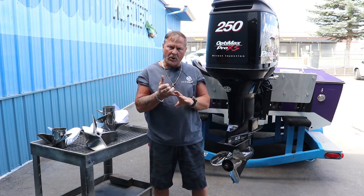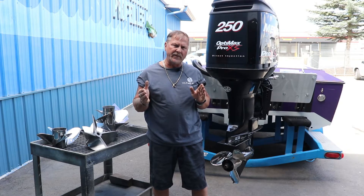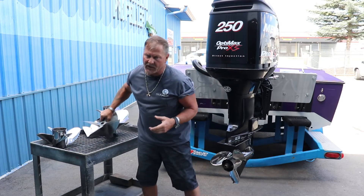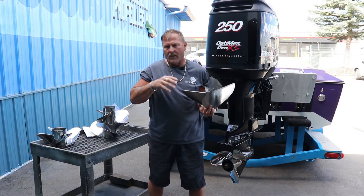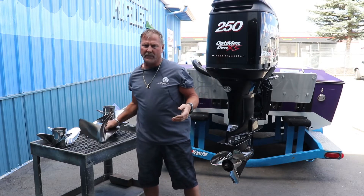If you're high in your RPMs or low in your RPMs, or you want a little more transom lift, we can usually do that with some alterations of your propeller. Some propellers, such as cleavers with designs like this, may give a little bit too much transom lift. We'll go into a round ear or we can thin out the blades for some better performance.